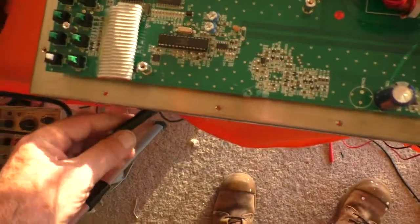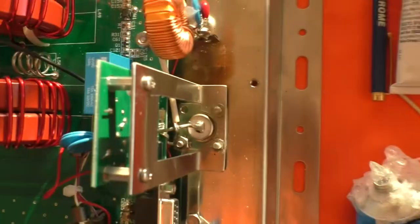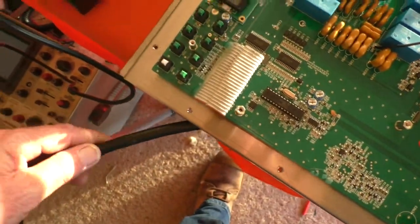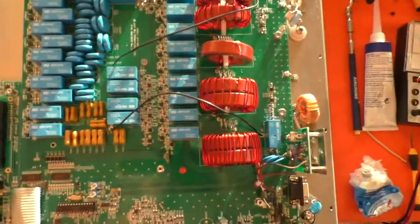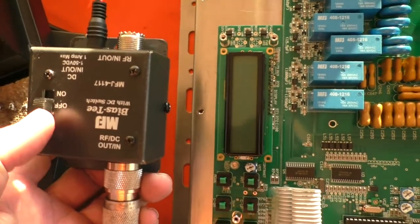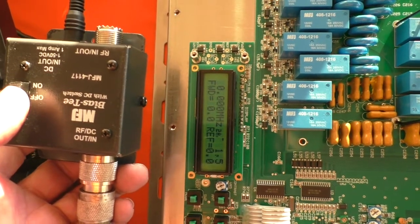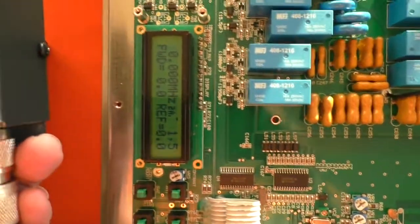You can see here there's a coax that disappears underneath, connected by a 90 degree elbow connector to the other side of that socket. So I'm feeding it with power along my RF tail just as I did with the new one when I tested it. And I have here, as if by magic, a bias T. So if I flip the bias T on — there we go — makes a nice healthy sound, and the display looks to be doing what it should be doing.